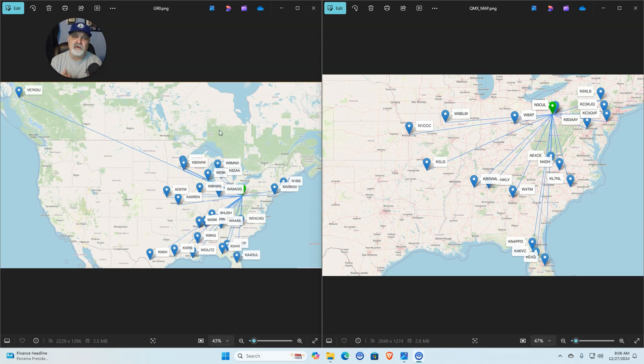When I run the G90, I always run it full tilt. Remember, this is running without a tuner — that's something to pay attention to. I didn't need a tuner because I had low enough SWR because I was able to tune the antenna. It makes a big difference not to use a tuner. I have a friend, N3WS, that always runs resonant antennas and never uses a tuner. When I use the QMX, there is no tuner built into that — so you don't want to always rely on the tuner; you want to tune the antenna down.